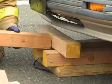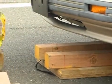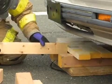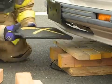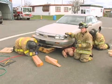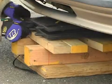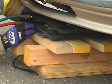When we do this, we're going to lift the front end up just enough to extricate this patient, then lower the load onto those two capture stacks. We have four-by-four cribbing finished out with a top layer of two-by-fours — a solid base for our airbags to go on. We always use stacked bags; we advocate that for the added height we can get in one of these lifts. We always want to put the bigger bag on the bottom and the smaller bag on top. We want to build up as close as we can to the underside of the load we're going to be lifting so we can maximize the lift capacity of the bags. We don't want to use the bags to make up space.